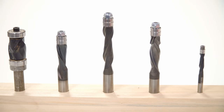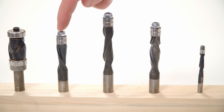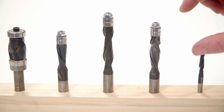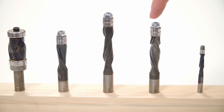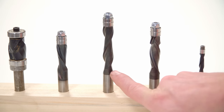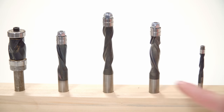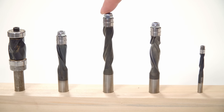Future Jay jumping in: as I'm recording B-roll footage I realized I failed to consider cutting length — how much material do you need to flush trim? These three spirals are all half-inch shank spirals, and the effective cutting length is different on all three. This one is a down cut spiral, this one is an up cut spiral, and this one is a compression. The compression has the least effective cutting length. The lengths are roughly an inch, inch and a half, and two inches. Take that into consideration when shopping for a flush trim bit.